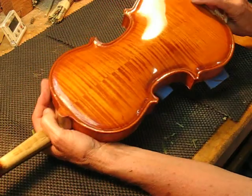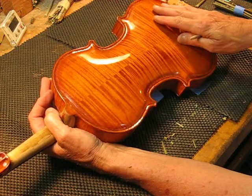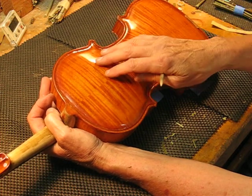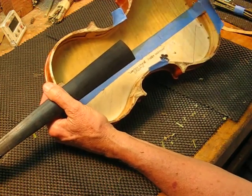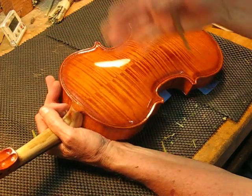After the Dutch rush, also do the outside. If you're going to stain or dye, do the staining and dyeing first, then do the propolis, then the Dutch rush. You'll need to do color samples first because you can see how much it darkens the wood — that throws off all the colorations. Then on top of that, just do your regular varnish.